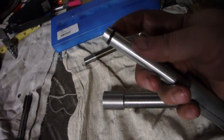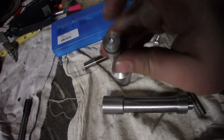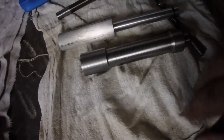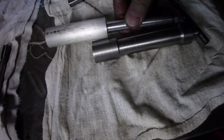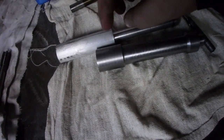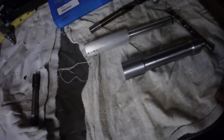Well here's the piston. The o-ring grooves are in there. You still got to put a little concave on the top so you can put your char cloth in, or whatever you have. I haven't figured out what I'm going to do yet. I'm probably going to cut it off right about there so that way the piston can go up - machine this back and then put the piston in there and then machine it so both sides are the same.